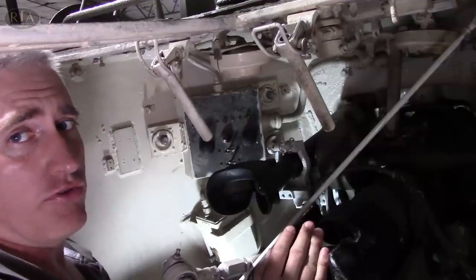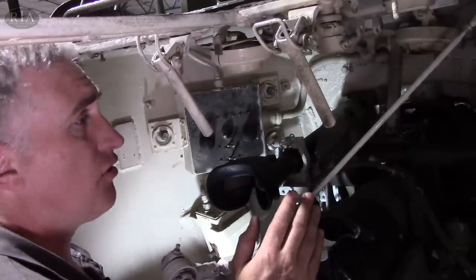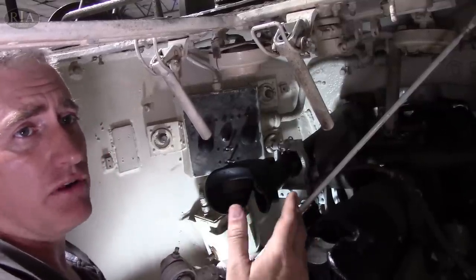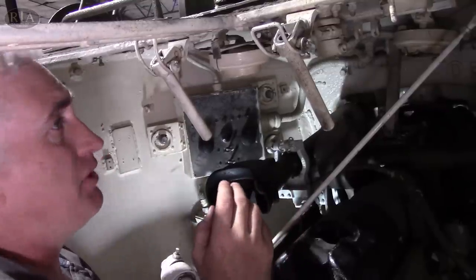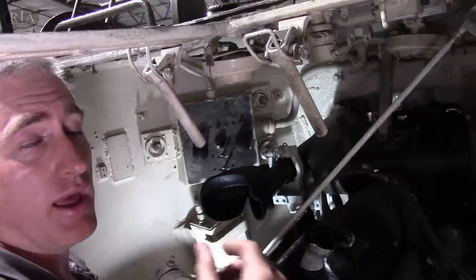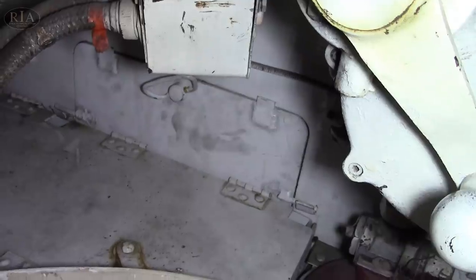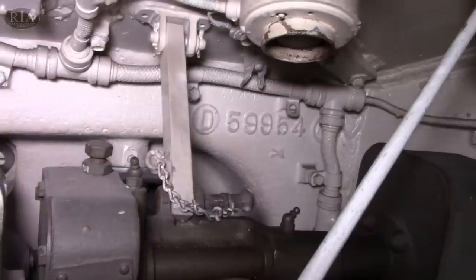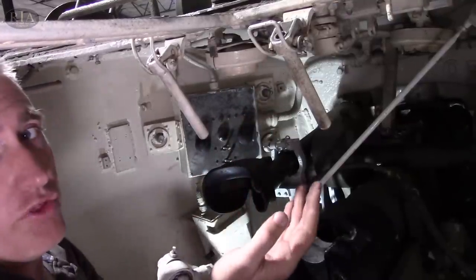It is a rifled gun that shoots 37mm rounds. The APC round was rated to do about 2.1 inches of penetration at 500 yards, so you're not really going to be taking on main battle tanks with this with any great regularity. Although I have seen in the archives a discussion of an entire company of Stuarts that hounded a Tiger to death — they were very specific about it, but they say it took a while. I believe it — eventually something went through, the golden BB, they call it. The auxiliary motor is located behind them with a very simple start button, and also in the bulkheads in the rear you'll see the access ports for the Hydromatic transmissions. The 37mm has an internal travel lock as well, just to keep the system stable as you're bouncing around cross-country.